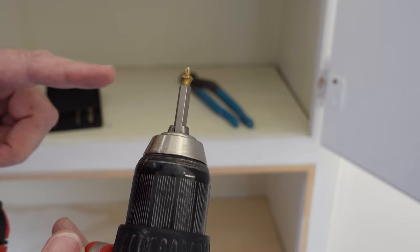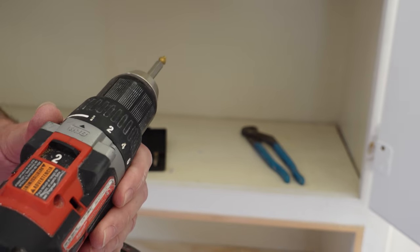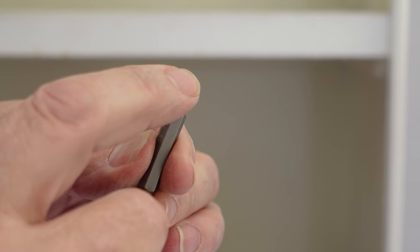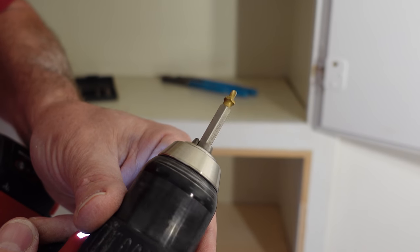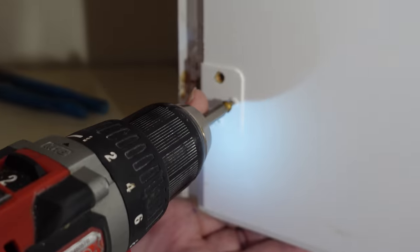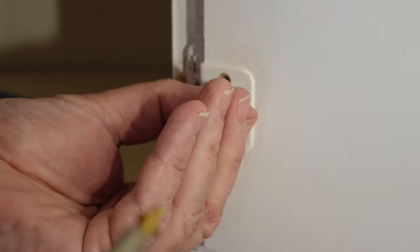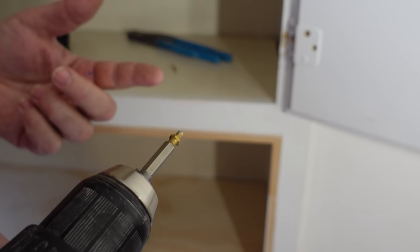I've got it in my impact hammer. On one end there's a drill bit and it drills in reverse — the drill is going backwards right now. The other end is the extractor. I'm in reverse mode, like I'm removing a screw. I put the drill bit right there in the Phillips, slowly turn on the drill, and that drill bit grabbed that screw and pulled it right out. That's best case scenario.